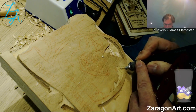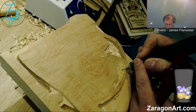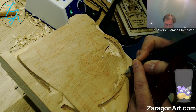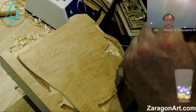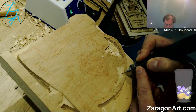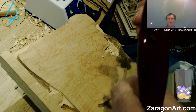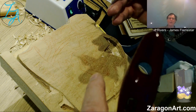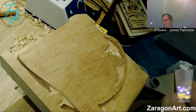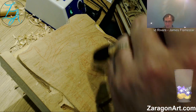One of the difficulties that you will have, and I have, is when the tool is switched on but isn't actually in contact with the wood, it heats up. Now, actually, your tool will be less of an issue with that. But with mine, the tool heats up, and if I just put that down on a piece of wood, I get the black blob, the dreaded black blob, because it's got a lot of excess heat. It suddenly dumps into the wood and makes it go really dark. And if you're only wanting a really light colour, then it becomes an 'oh no' moment when that happens, and now you have to worry about how to deal with it. And there's all sorts of tricks that you do with it.